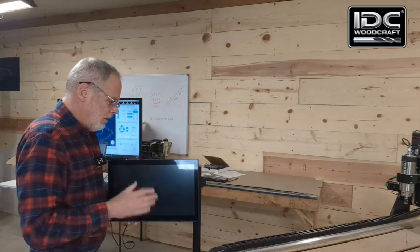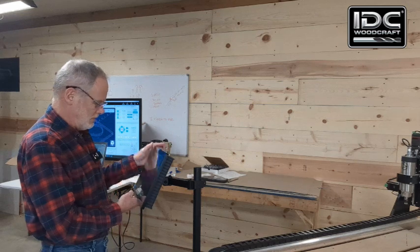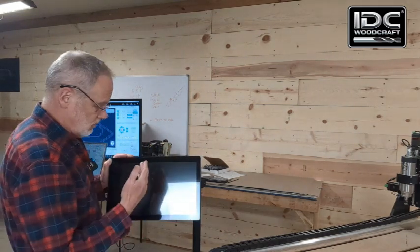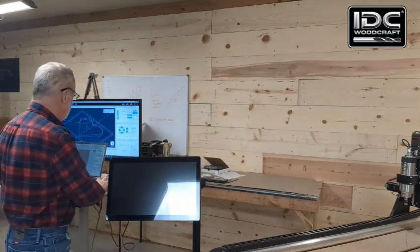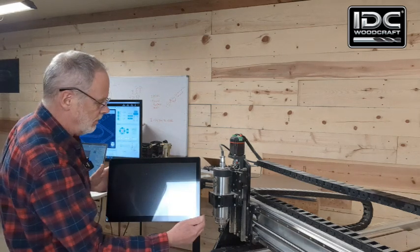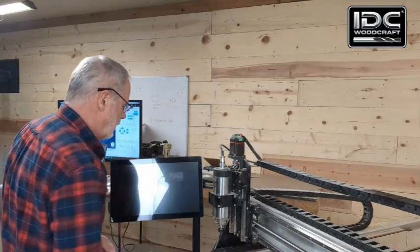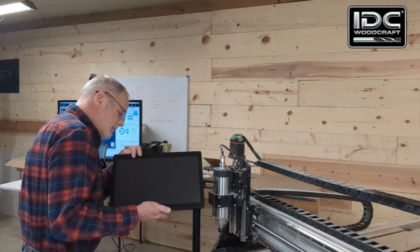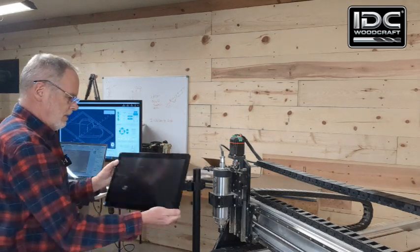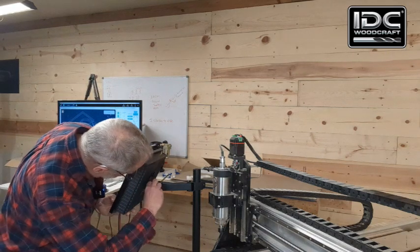Now that we've got the panel up here, we can adjust the orientation — it will be oriented upward so it's clearly visible. First, make sure again that the machine is not going to run into it. Bring the machine all the way forward to confirm it doesn't touch the control panel — and we are good. Bring it back, orient the panel the way you want it, and lock it in. Get into the back of it, turn it around while it's tilted upward, and tighten down the orientation.